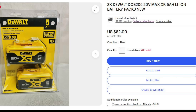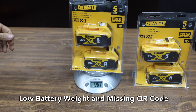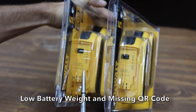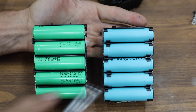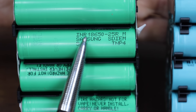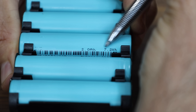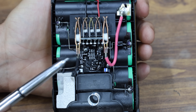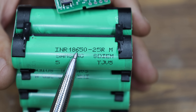There's no circuit board. To make sure that this wasn't a one-off, I bought a total of three pairs of suspected counterfeit DeWalt batteries from two different sources, and they were all indeed counterfeit. The authentic battery from 2024 has a circuit board that looks quite a bit different. Both batteries should be using Samsung 25R cells. The authentic battery uses the correct cells, but the counterfeit's brand information is missing or hidden. Comparing the counterfeit to the DeWalt battery from 2019, the 2019 authentic battery also has a control board and Samsung 25R cells.